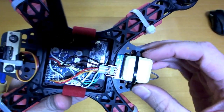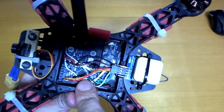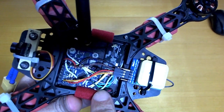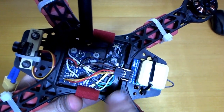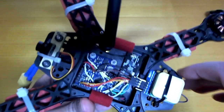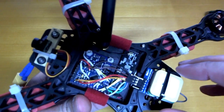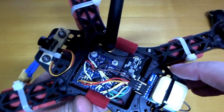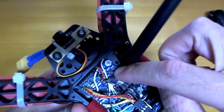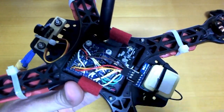This module here — the only way this is really going to work on a Pro Mini is by using the U-Blox binary protocol, because it's a lot lighter on code and you don't need to parse any NMEA strings or text strings or anything like that. I also had to cut out the barometer code and the compass code that this IMU breakout board here is capable of, because that wasn't going to fit into the memory of the Pro Mini either.